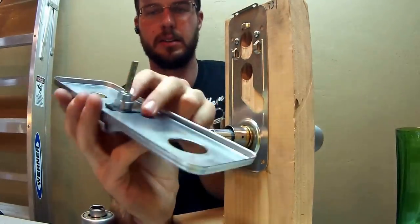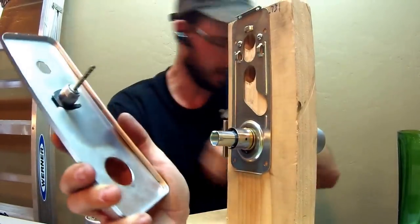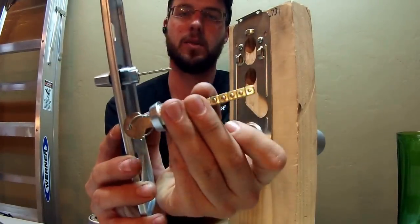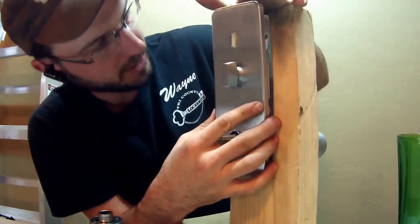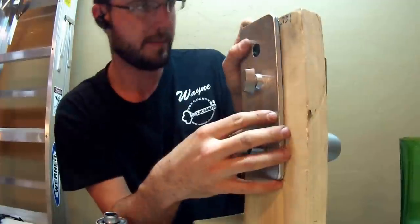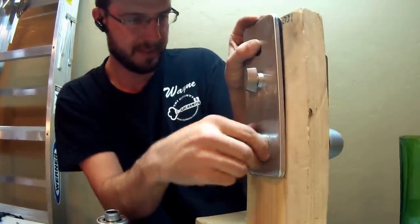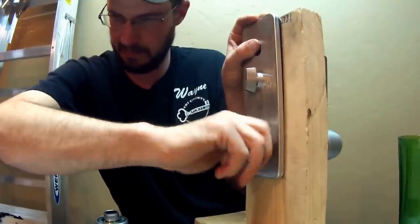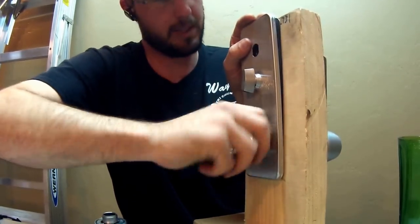You'll have your bypass thumb turn piece here — it just clips in with this metal clip, slides right in, and you pop that clip on. Then you can adjust the tailpiece to your desired length, or you can use the key — both are pretty much the same thing. Turn that to line up correctly, and you'll need your threaded cap to go here; that holds this plate on from the outside. Just thread it right on there by hand as much as you can.